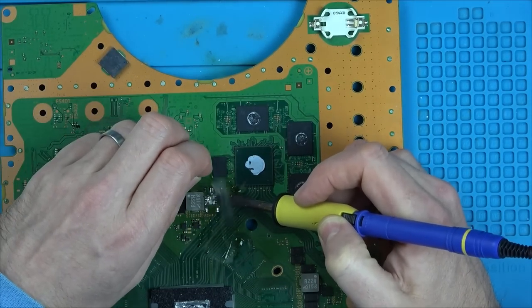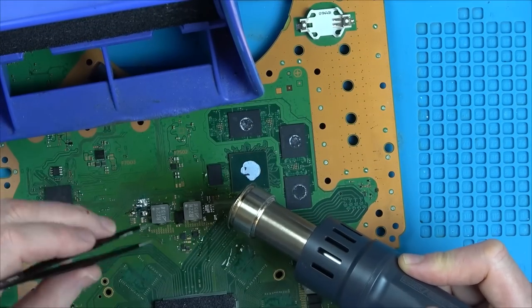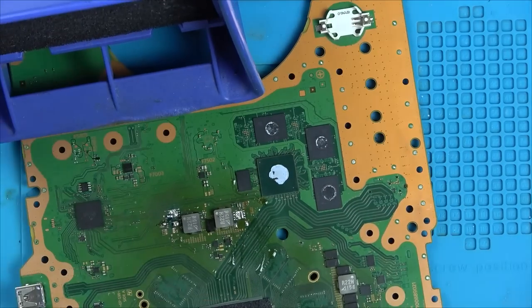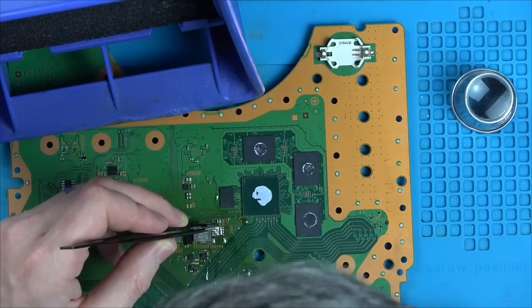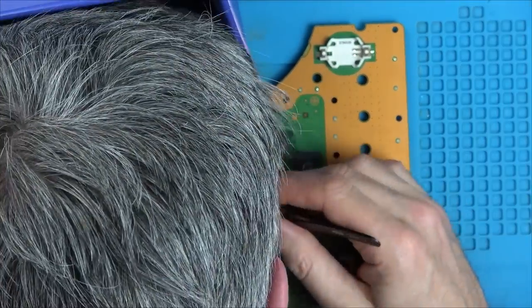So basically, on the faulty MOSFET, the one that was burnt, remember the burnt corner where I couldn't take it off next to the explosion on the board? Well, all the outer pins on the MOSFET are shorting to the massive inner pad. So I wasn't sure if that was normal or not. As it turns out, it's not normal.